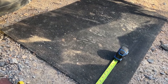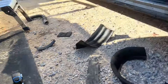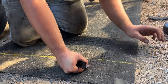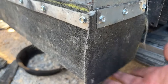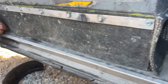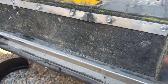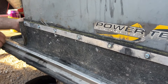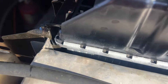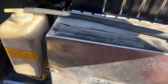We're changing to a floor mat — a rubber door entry mat type thing. It's real stiff. The airbag rubber is too curvy up under there and wasn't sealing right. It's a lot tighter seal than we had when it got here. I cut a piece of pipe insulation and we're going to wrap it around on top to seal that piece off so air has to go through the radiator instead of up the side. The old one didn't have that — there was a little gap — but this should seal it up good. It's got a good seal now.